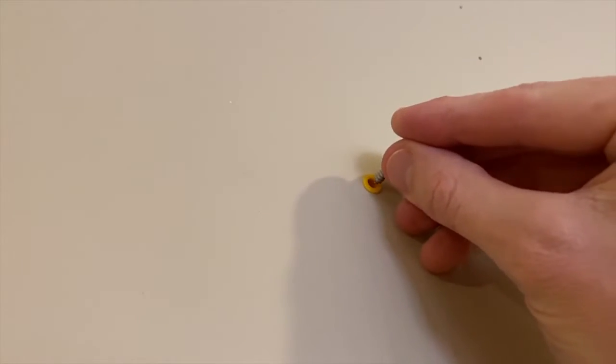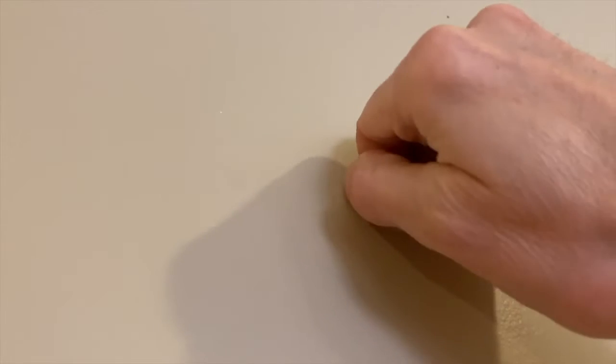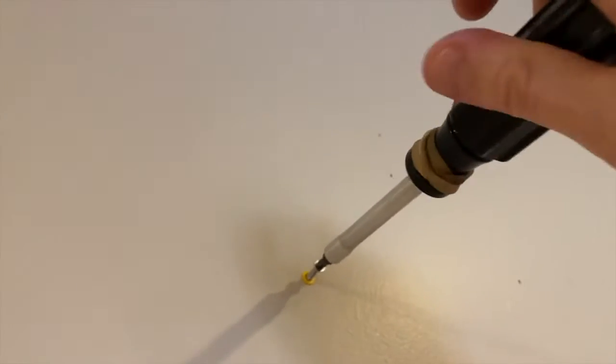Next, grab the screw. I recommend just hand tightening it for now. And once it's tight, you can grab your screwdriver and continue screwing this screw in place and locking that drywall anchor inside the drywall. Making progress, the 2 upper drywall anchors and screws are secured, and I'm going to rest that rack back in place and verify it's level.